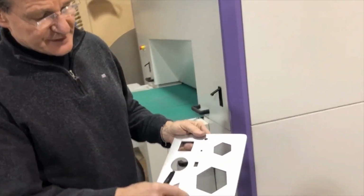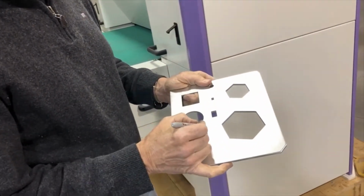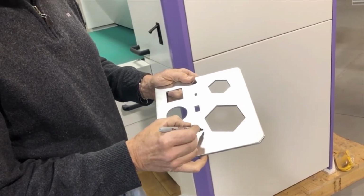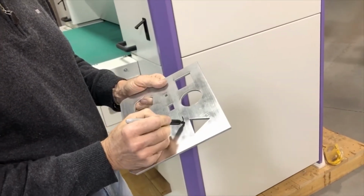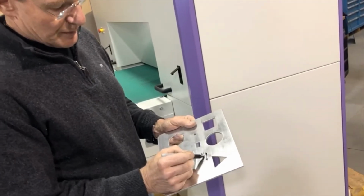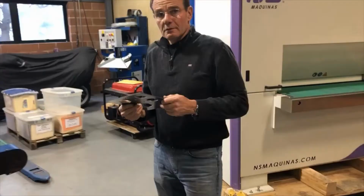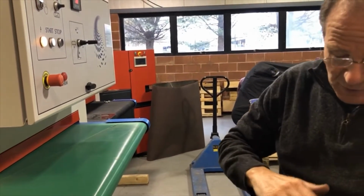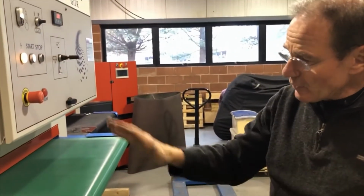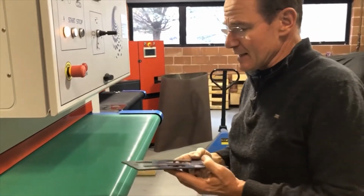So, very heavy pressure in 3/16, diagonal, 2 feet a minute. So this is our direction, 2 feet per minute. And here we are running parallel, 3 feet per minute. And also on the cross belt. So, now we set up our belt standard, material thickness. We have a fairly quick belt because all we want to do is remove some of the dross. We don't want to go too much into the surface, not necessary here on the hot roll. And yeah, just hit it through.